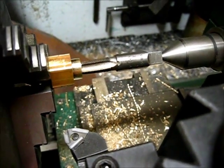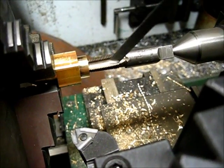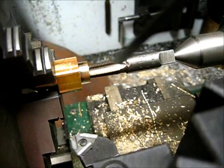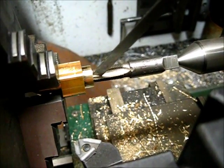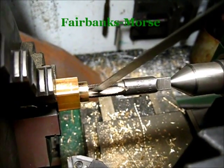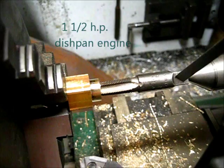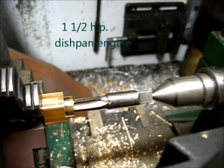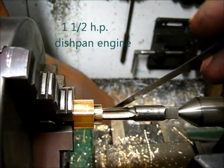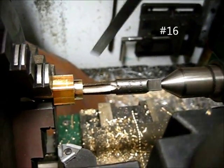Your typical setup for threading - it's a 1/8 inch pipe taper thread, and this is the medium in the three-tap set on the taper. I just use a center in the back of this, and I'll turn this here with a wrench as I am putting a little pressure on the ram, just enough to feed it and get it started, and everything will be straight and true.